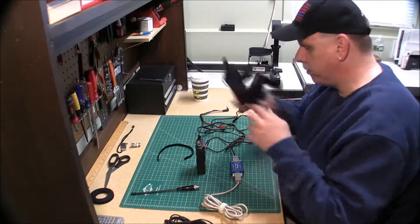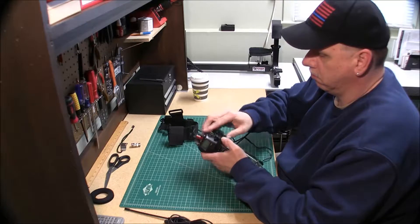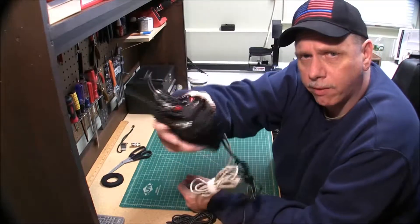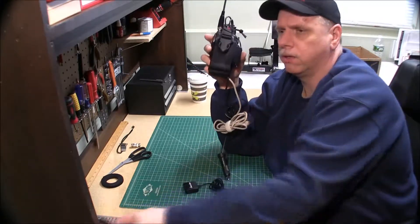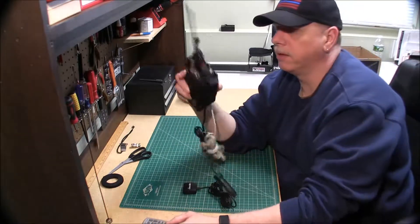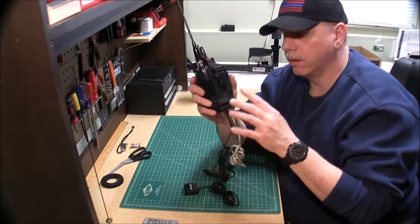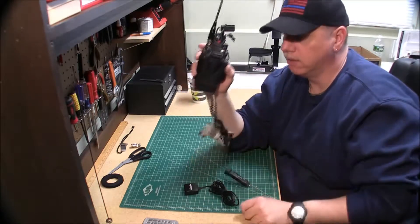Let's put it all together inside the radio holder. One self-contained APRS tracking unit. 12-volt power supply. This is the cable to connect the GPS to, and there's also an external antenna we can connect to the vehicle. It's portable, and that means with another external battery pack that I get to construct, I can power this whole unit by removing this and connecting that battery pack to the power pole connectors. That would make this entire unit portable where I can carry it on me.